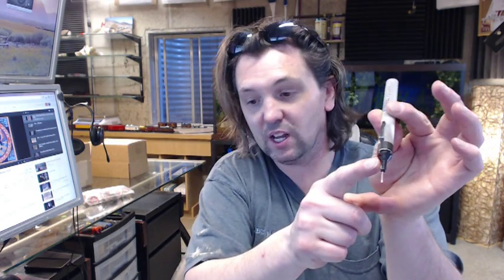The instructions on the use and application of this tool are below this video, but they read: remove the hose from the fire extinguisher, place it on a dry non-conductive surface, then simply hold one hose coupling with one hand and the tester with the other. Use the probe to touch the other hose coupling — your body completes the circuit — and if the hose is good and there is continuity, the red LED in the tip will grow bright enough to be easily visible.